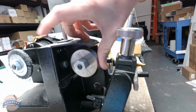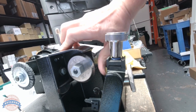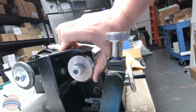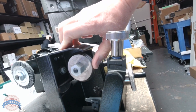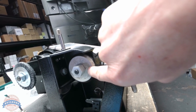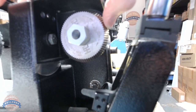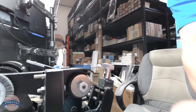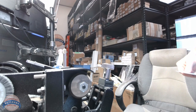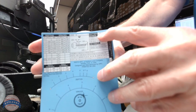Standard Blitz machine. Now the issue is I don't recall what cutter I have on the machine, nor do I know if you can see that very well. I'm looking for the cutter number. I can see that it's right here, and it's not the right cutter. CW90MC is what's there. I doubt that you can actually see that. I was cutting Corbin Russwin before, and this machine requires the CW90MC, which is why that cutter is in there.